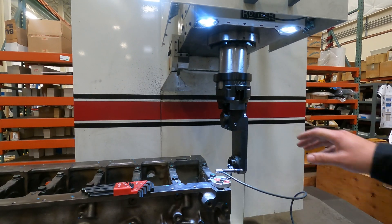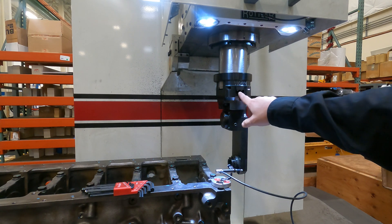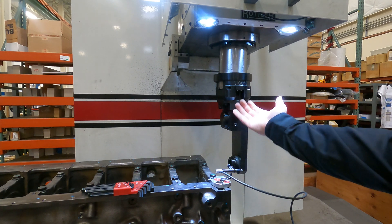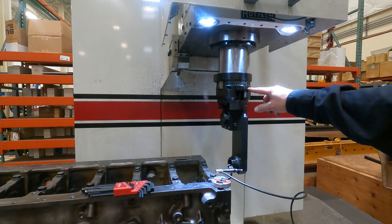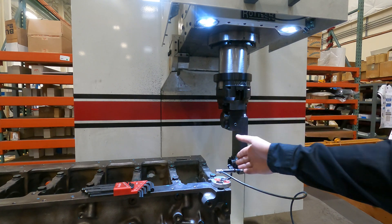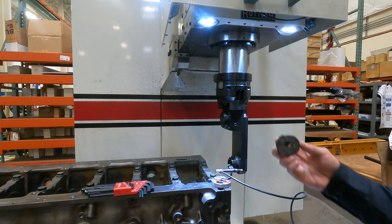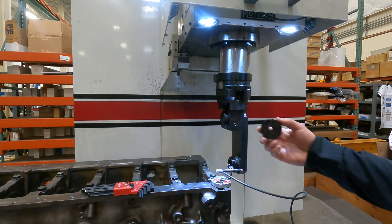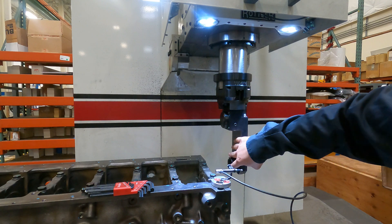On this right angle drive, it mounts up — it actually goes into the spindle just like changing a tool. It's a Cat 40 taper, so it'll suck itself up. Then on the front, we have basically two set screws that can push and pull. We want to dial in the face without having any of the cutter head bodies on. We have our spacers which hold our tools, and you want to dial in this rad across the face with nothing on it.